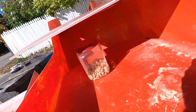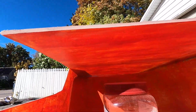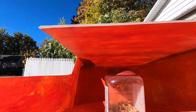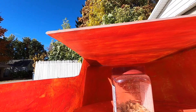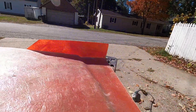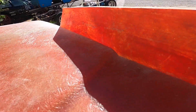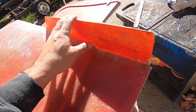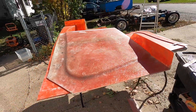You can see it's very tight up in there. On a plus note, the molds are mirrors of each other so they will bolt together, and those will be sealed with some infusion tape. Next I have to build up a flange right there so the molds can bolt together and seal, and so it won't flex when it gets under vacuum.